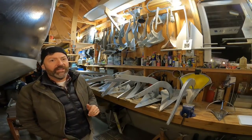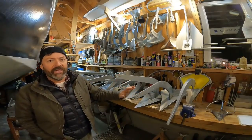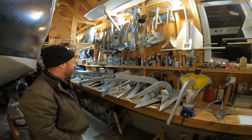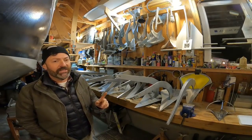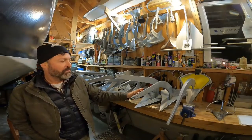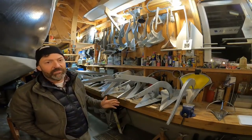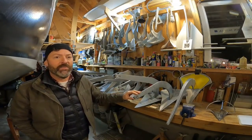It was my hope to run down the line at the end of this video and discuss anchor behavior in greater detail, but we're over an hour in, so I'll just make a few points. Creating a proper ranking for anchor behavior is probably not possible — at least not by me. For example, a steel Spade anchor has a tendency to make really high resistance in that sandy mud, but it tends to pull out and be completely loaded with mud with a very low chance of resetting. On the other hand, an XL anchor is likely to roll out at a lower resistance number, but when it does it has a much higher chance of resetting. So you tell me: what's better behavior? One could argue that since the Spade has generally higher numbers, maybe you just won't get there and the anchor won't pull out — that'd be great. Then again, you just can't predict exactly when an anchor pulls out; maybe the Spade has a slightly worse part of a seabed or there's a stick involved.